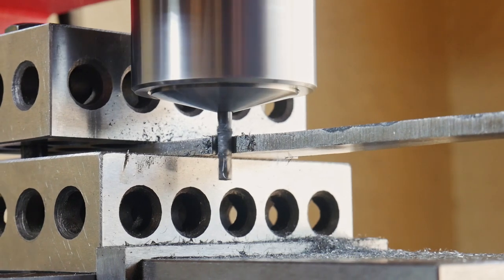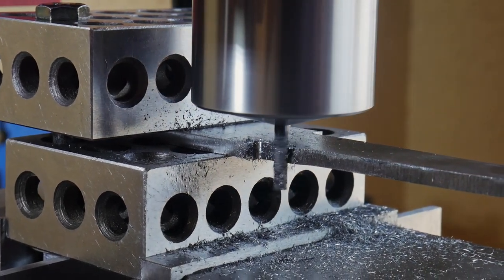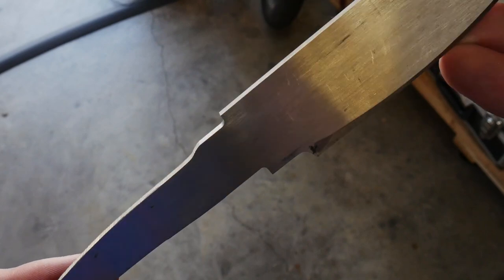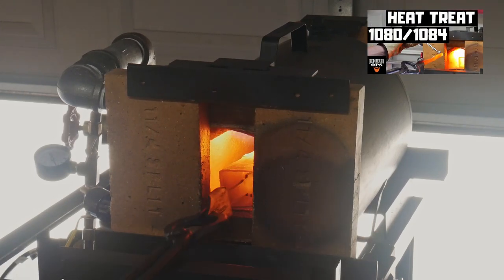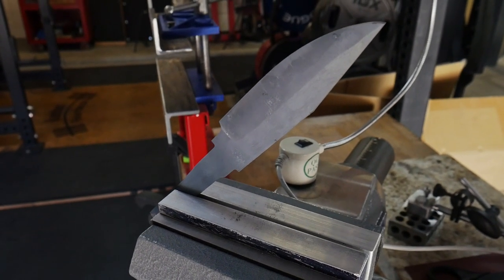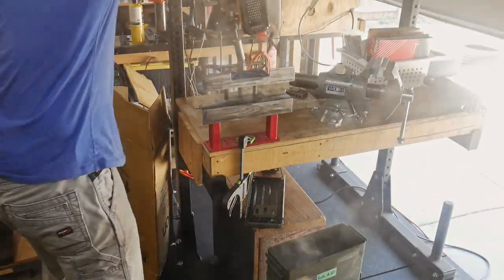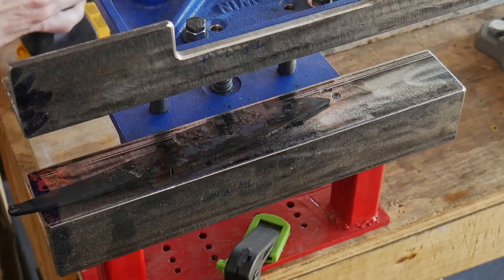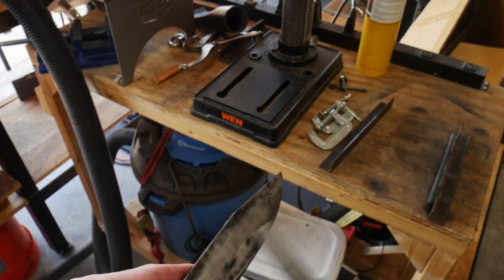There are a few finicky parts of the setup and clamping mechanism, so I think I may eventually make a dedicated jig just for doing this operation. Now that we have our shoulders milled in we'll move on to heat treating. I have a full video on how to heat treat 1084, so if you're new please check that out. On this knife I did two normalizing cycles and then quenched it in Parks 50, then clamped it in my straightening jig so that the knife stays straight as it cools. So far the straightening jig has not failed me.